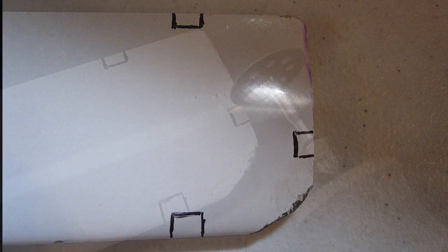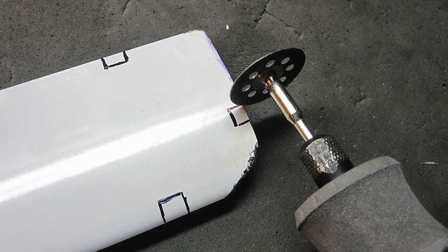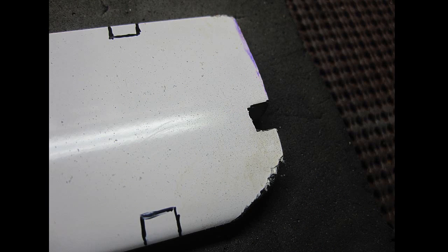First of all, in order to be able to see the entire ring, an LED must be placed on the tip, on the leading edge, and on the trailing edge of the blade. In order to keep the LED from sticking out, I used a Dremel and cut a small slot the width of the LED into the blade.